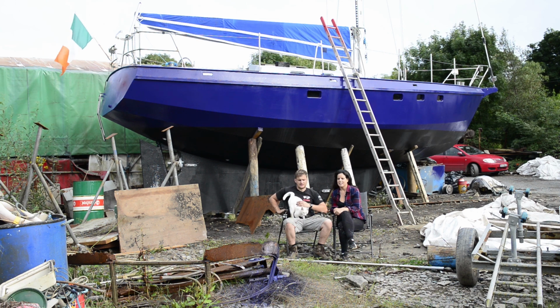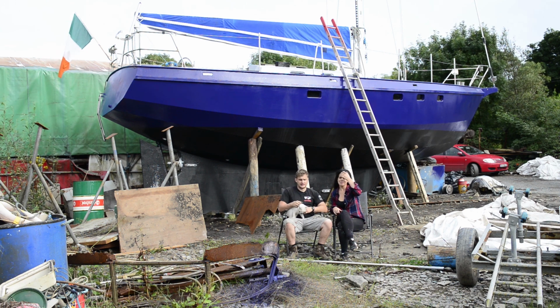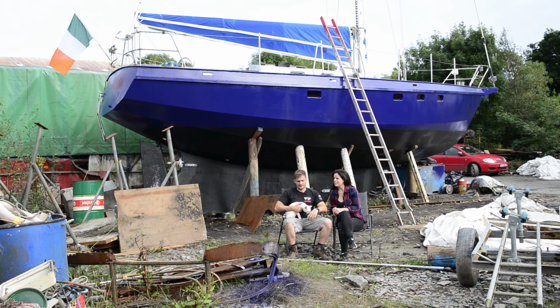The few spots as well under the shores, they're called, under the sticks, I'm going to anti-foul under those as well. And then we're going to anti-foul the few bits that we made a mess of, and pretty much lift the boat in and check for any leaks. We'll be frantic, maybe 5 minutes, looking around, seeing if the boat's leaking and sinking.